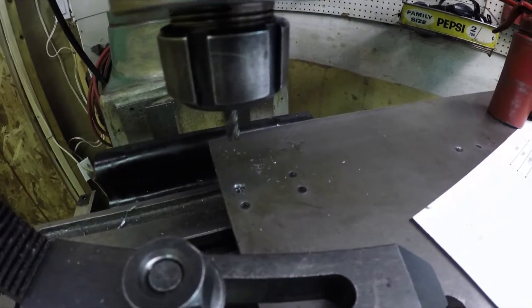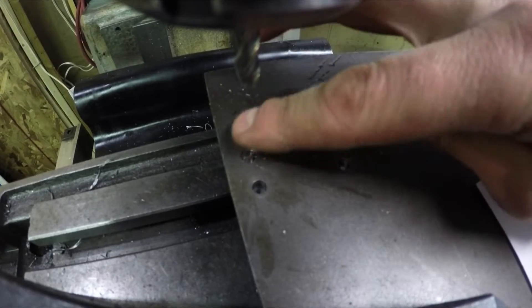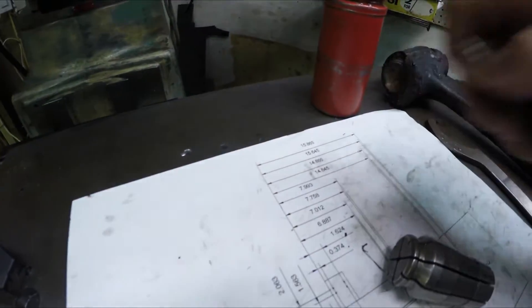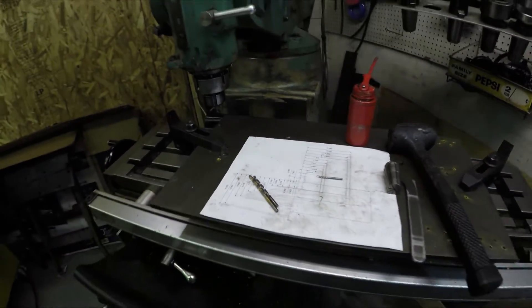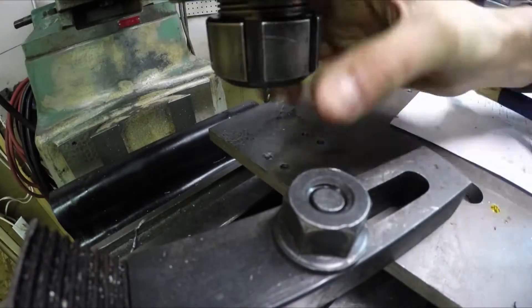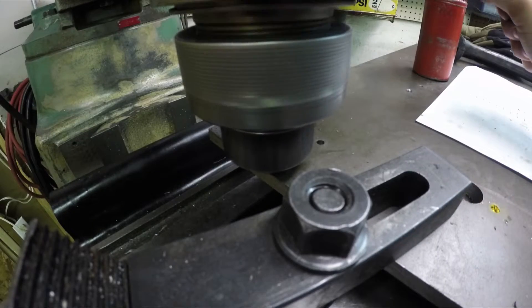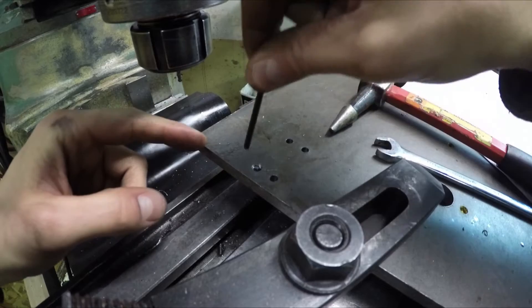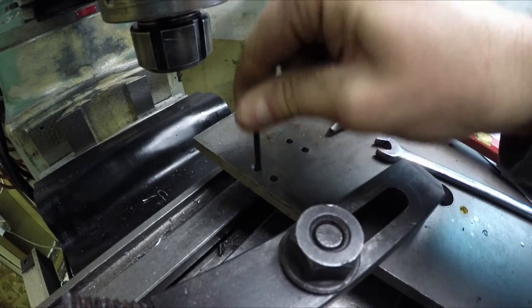What I did is I put my quarter-inch solid carbide end mill in there and just faced that thing to get it nice and smooth. Then I have a 1/8 solid carbide ball-nose — it's the only one I have left — so I'm going to try and feed that down in there and then get on it with an easy-out. Turns out I didn't even have to use the extractor — the piece just fell right out. Well, ain't that perfect! Excellent.